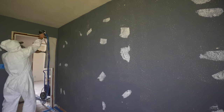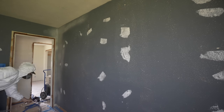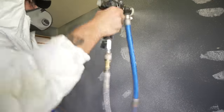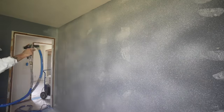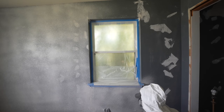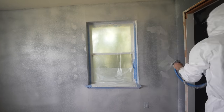This next room being dark is going to be really helpful for you all to see better too. I forgot to turn the air on — let's try that again. I realized how much of a win using this machine without the hopper on top is, because it allows me to use a spray shield to mask off doorways and other things instead of holding the gun with two hands. After you go over your wall twice, spot check anything that needs it and move on. On the left side of this wall I can still see my pattern — that's because I did pretty straight lines instead of little spirals and I can see the crosshatch. I had to come back later to break that up because it was noticeable.